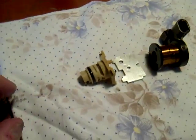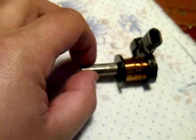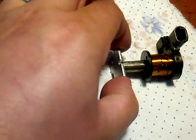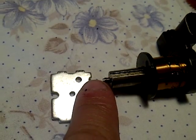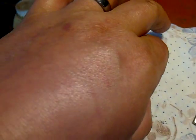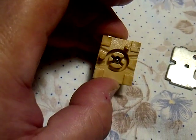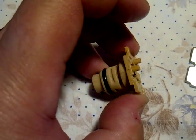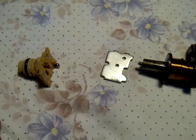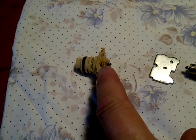But this is how it actually works. It's just an electromagnet that has a little plunger inside that pushes in and out through this little plate. And then that little plunger has a check valve ball. It sits in here, so it closes this ball and closes this valve here with the O-ring. So when the solenoid activates, it has the ball closing that little ball valve.